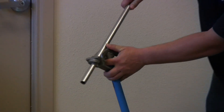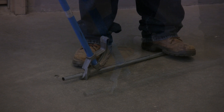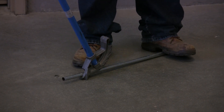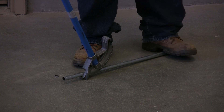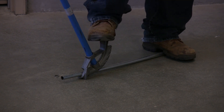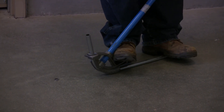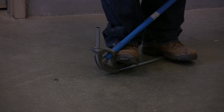Once you've got it lined on the arrow, flip it up to lay it on the ground and you're ready to bend. With the line on the arrow, the first thing we do is make sure this pipe does not roll around. So I hold it down with my left foot. You apply adequate foot pressure and then you bring the conduit up to 90 degrees.